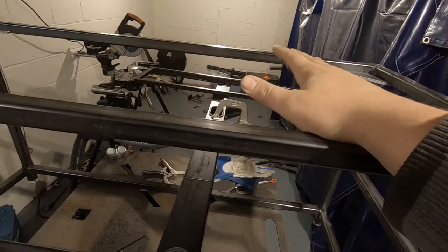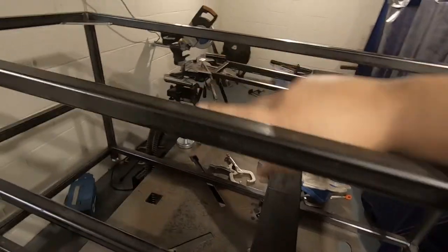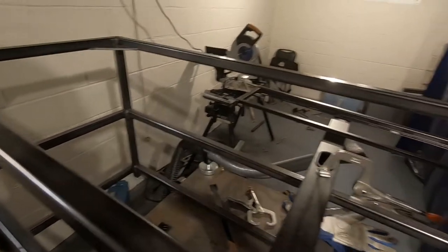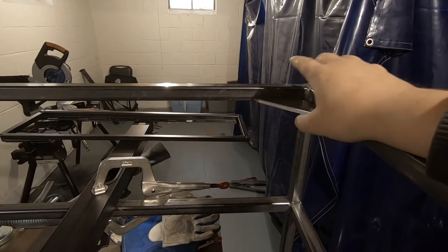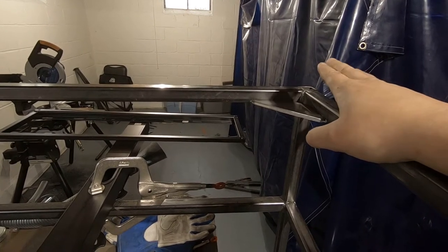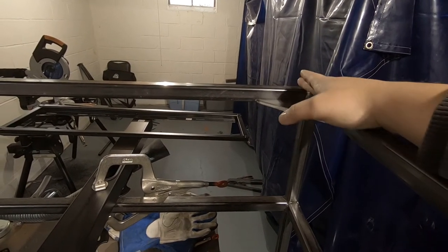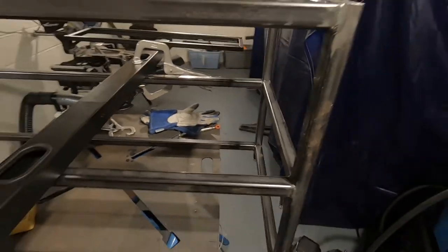And depending on how much those flex, I also made a few tabs to sit in the middle to stick out of the shelves. And the nice thing about this is that this is 1-inch square tubing, this is a 1/4-inch plate, and then I have a 3/4-inch piece of plywood that goes in here, so it'll be flush to the top on each level that I do this with.